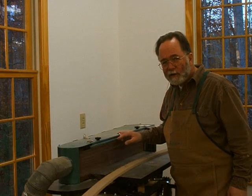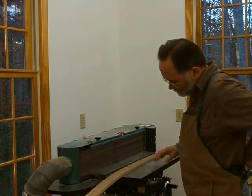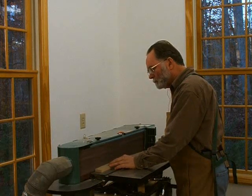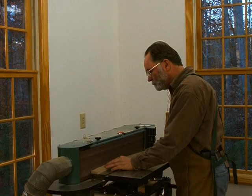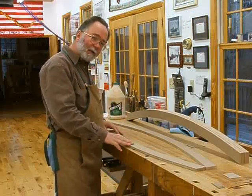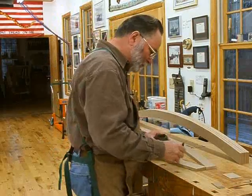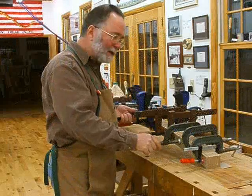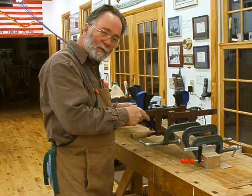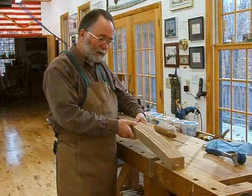This stationary edge sander is the perfect tool for smoothing off the outside radius of this rib. I've got my ribs all cut out now — you can see how they'll stack together — and now I'm going to go ahead and glue these together using a little bit of Titebond glue with a brush. Even though this is just a bending form, it still takes a lot of clamps to put it together to get the glue joints to be nice and sound. I'd be using even more clamps if this were a finished product. Now I've got the six layers of the form glued up.